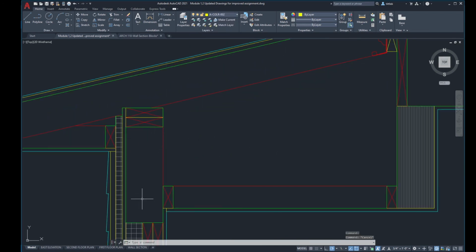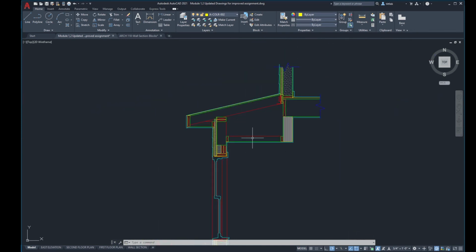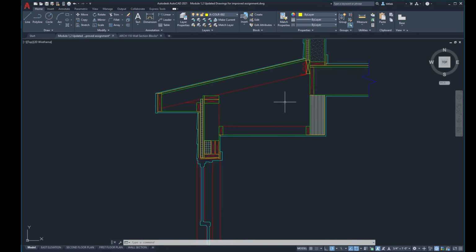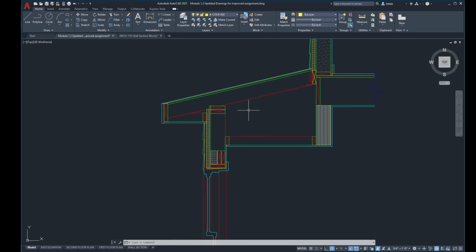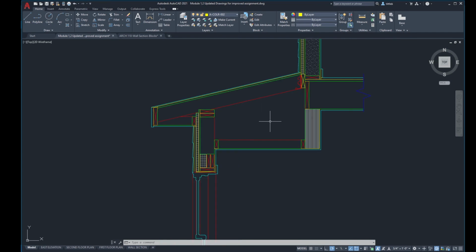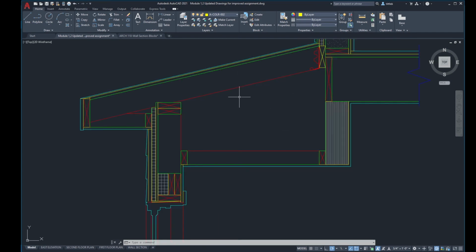Finally, this entire cavity, this wall cavity as well as this soffit, needs to be insulated, because if this is the exterior and this is a roof, according to the energy codes in our zone 6 here in Delhi, or in Delaware County, this roof has to have, I believe, an R49, which is a very high R value. So if this soffit went all the way up and we only had this 2x6, we would not be able to get this insulated properly. We wouldn't have enough insulation to meet code. Now, I believe if you don't have enough vertical height, the code allows for an exception where you can do it at R30, and that's essentially what I've planned for here.